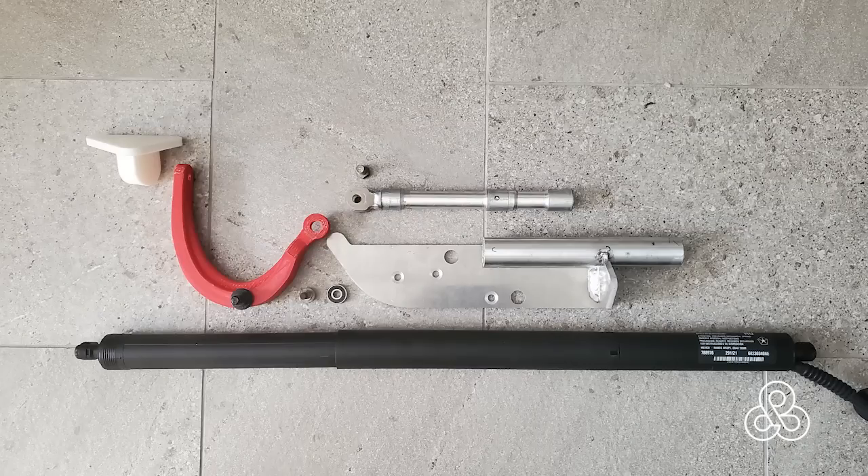Here are all the components together. Originally, when I was looking at electronic actuators, they were either way too expensive or the ones on Amazon and eBay had poor reviews — failing after just a few strokes. Then one day I noticed that my wife's new van had this fantastically compact actuator on the lift hatch in the back, only about one and three-eighths inches in diameter. A little longer than I'd like, but cheap enough to fit within my budget. It came with a little ball joint that will fit right inside the hinge piece.